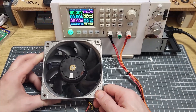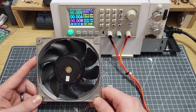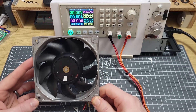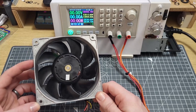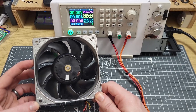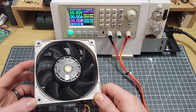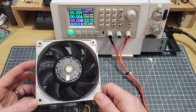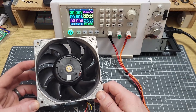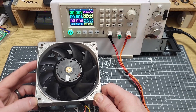The last thing to do with this video is another demonstration, and you may remember this monster fan from a video I posted a long long time ago. This is my San Ace 6000 RPM fan — I have three of them still. This fan at its top speed of 6000 RPM develops a similar level of static pressure to the blower we just saw. Of course the level of airflow is enormous by comparison — you're talking about just below 40 cubic feet per minute for the blower versus 260 cubic feet per minute for this thing. But the static pressure is comparable at those speeds.